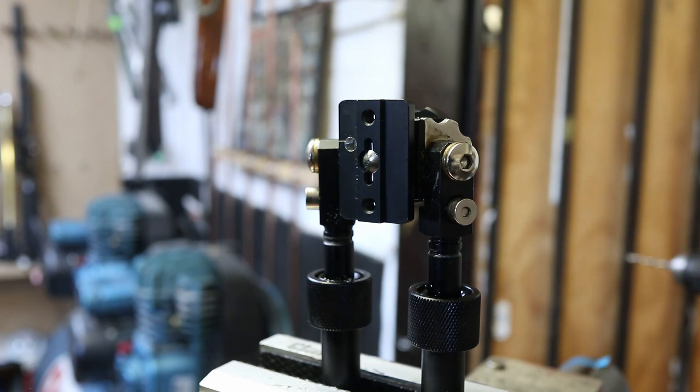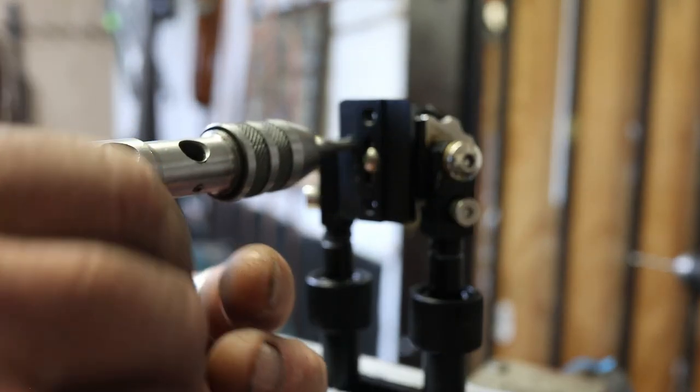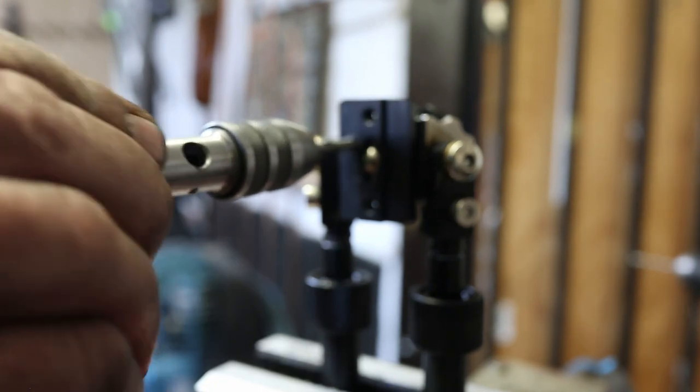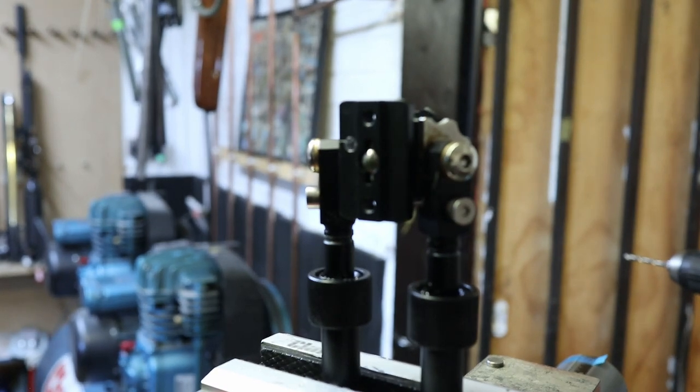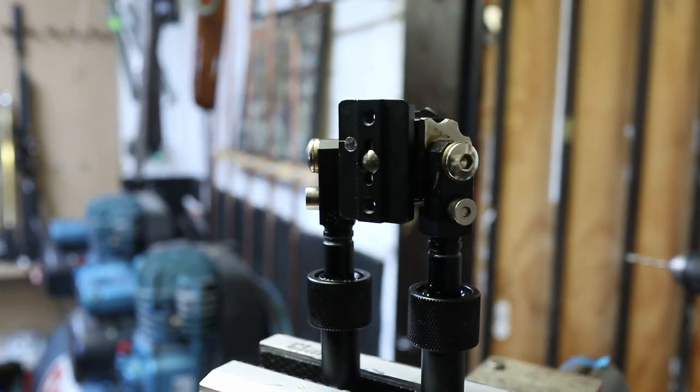I can come in now with my M4 tap. Because you've drilled 3.5, which is slightly under what you need, that'll be nice and easy to get a grab on and get the tapping process done. Bit of WD-40 again will help, but just try not to grab any swarf on your way back out, because with ali, it's such a fine thread, you can damage it. So that's now tapped. Ideal world, you'd have a compressor, just give it a waffer there.